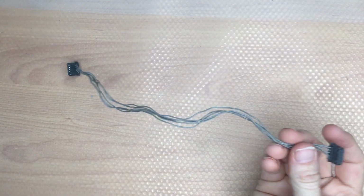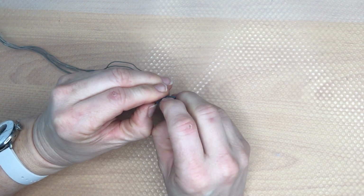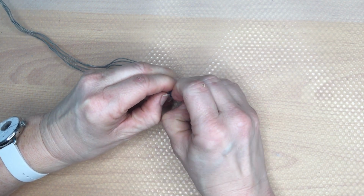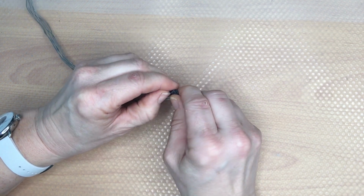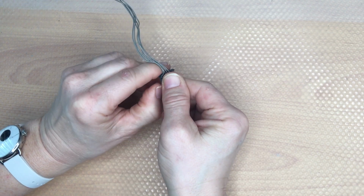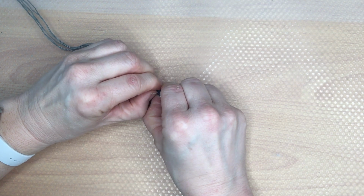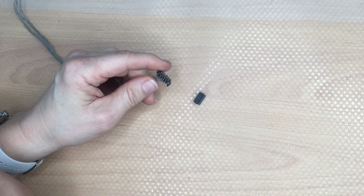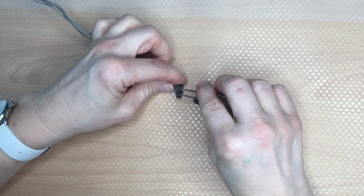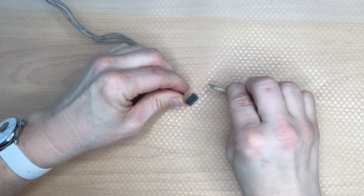Another thing that I recommend is to check the cables and maybe recrimp them, because it can happen that there are some broken wires, or from time to time it's broken. You cannot measure this with a voltmeter, but you can see this in an oscilloscope. The problem is the CPU reacts very quickly on any changes, and the tape mechanism might not work, might switch off or whatever. It is worth to do some recrimping.